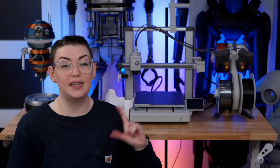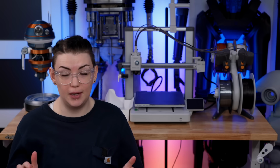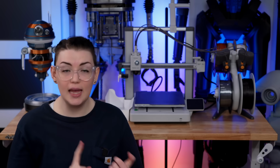Bambu has very specifically profiled out each individual one of their filaments, and even using the Bambu Lab specific filament profile for the closest equivalent to whatever I was printing with worked great. So there's one giant thing solved that you never have to worry about. Speed settings were another thing, never messed with those. That really leaves the only thing that beginners need to educate themselves on being infill type, wall settings, and support settings, which support settings are generally pretty easy.